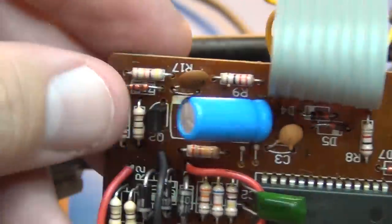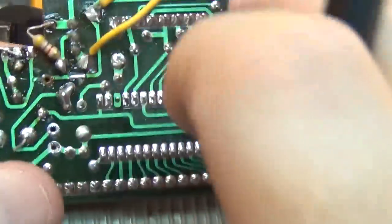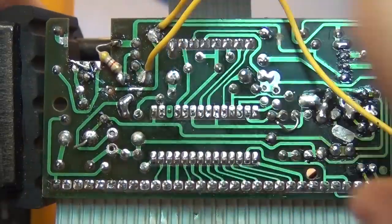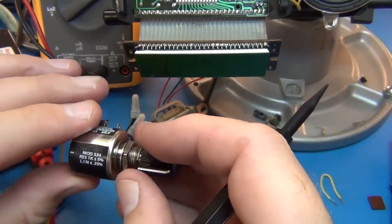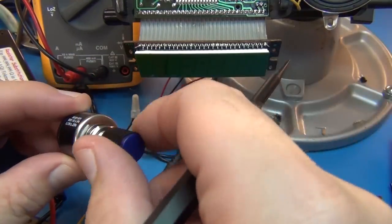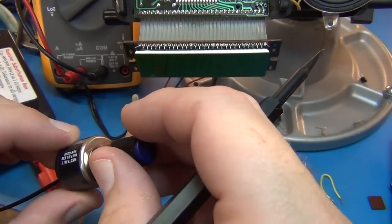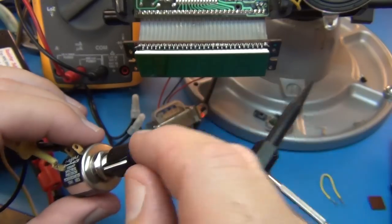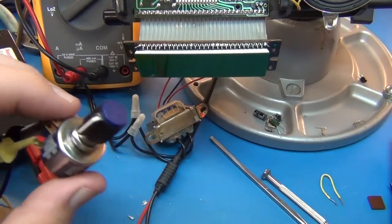And that's the hack. Other than this, pretty much all this over here, the circuits have been cut, so that doesn't work either anymore. It's not necessary for this standard clock signal. And I put in a 1K pot, 10-turn 1K pot, and start off at 1K, and then I can get louder and louder, and I'm going to watch my currents and voltages while I do this. So we'll show that little setup and demonstration, finding the right resistance values that I want.